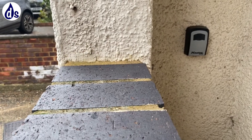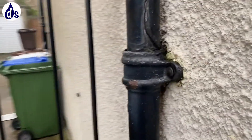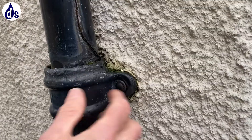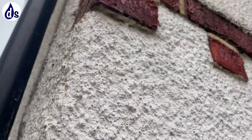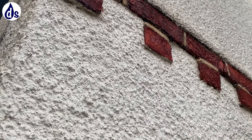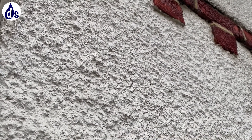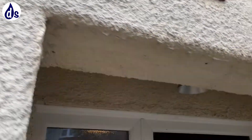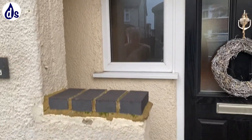It's acting like a thermal fin. There's a lot of heat loss around the external surfaces here and all the way around, and then it's exacerbated by this metal wrought-iron pipe — possibly a bit of moisture coming in behind there. These bricks here are going to become a little bit damp. It's not penetrating through — you're not getting the brown telltale signs of penetrating damp — but you're going to get heat loss caused by the wet bricks. It's uneven: some are covered and some aren't, and it's that unevenness that causes the dampness. I think this is water dripping off this coating onto this area here rather than a complete failure.